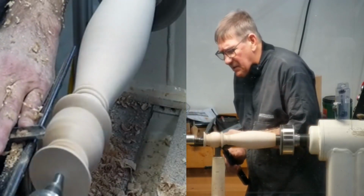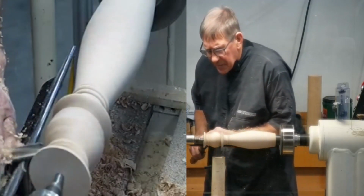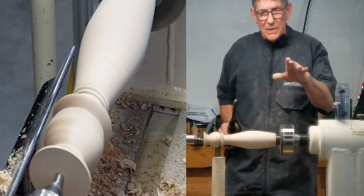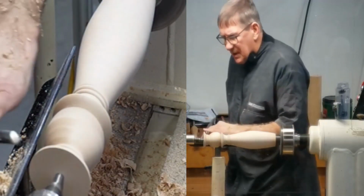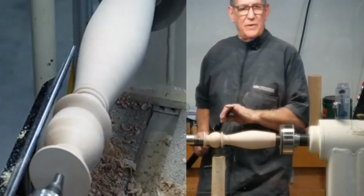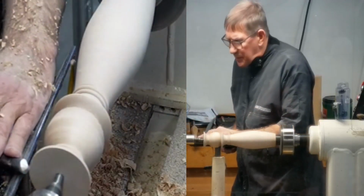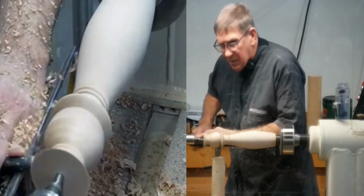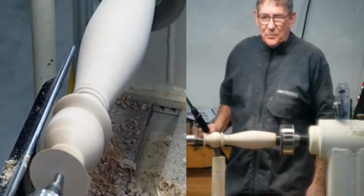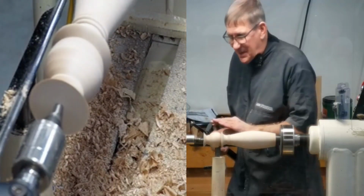So when we had Sandy Alt class, believe it or not, Mike literally taught me something. Mike was having a hard time doing this peel cut right here because he was trying to push and everything along those lines. As I was looking at it, I said, what you need to do is place your bevel here and then raise your handle. And all of a sudden, what took Mike an hour and a half to do, he finished up in 15 minutes.